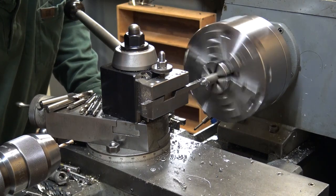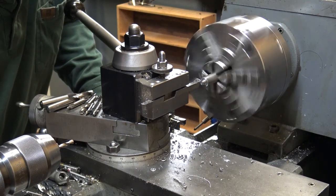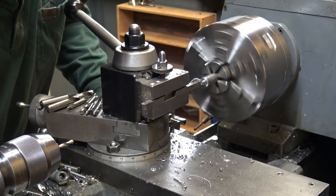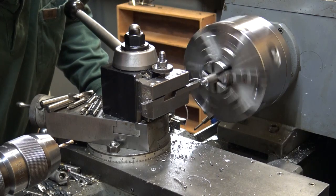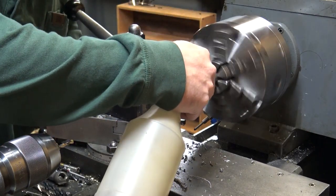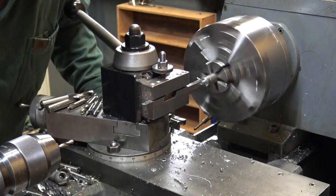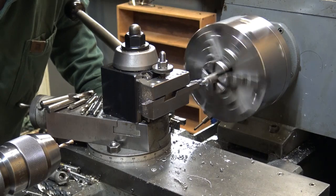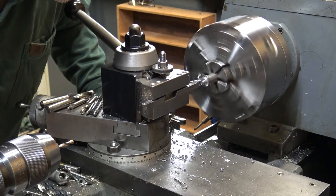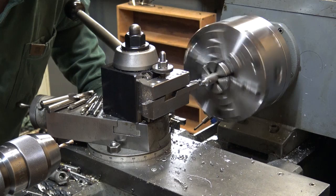It's already kind of dark, almost like a color case. Once you do the initial heat treat, about 600 degrees adds a blue contrast to it. If it were just shiny steel, it would look like a real iridescent blue, but when you're doing it on top of the case, if you don't polish in between, it just comes out a nice dark blue. Just enough of a contrasting color in there to make it look unique.